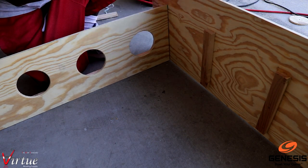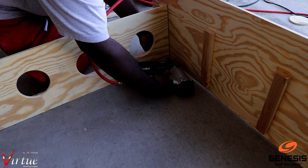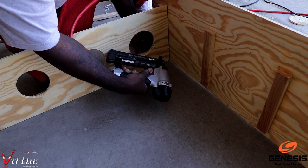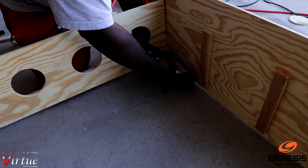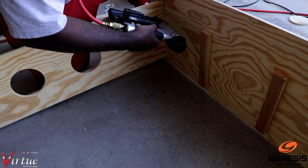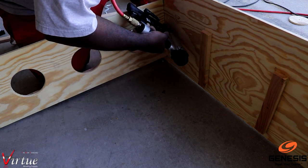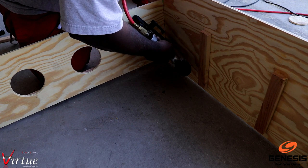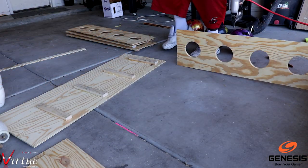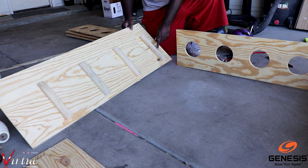Now, the back of your shelf is gonna line up with that inch and an eighth back set I had you set, right? So inch and an eighth right there, boom, hit it. Push that in right there. And fill that in. Alright. Once again, like I said, once I have this part up, it's smooth sailing. Here's your bottom, 3 inches.